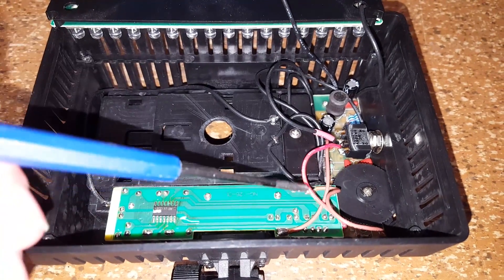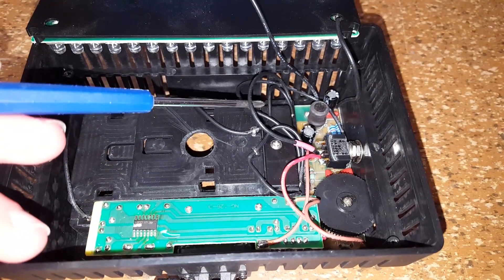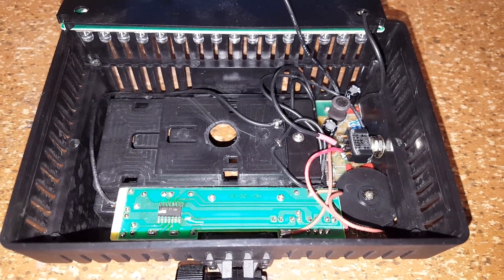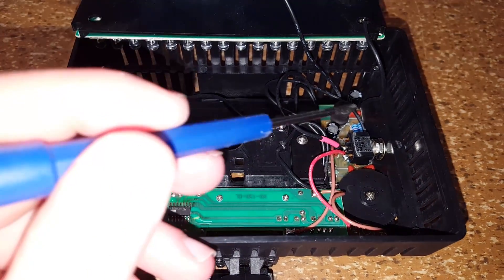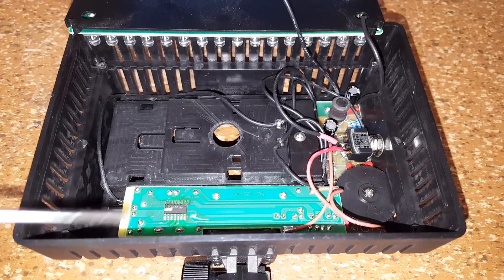The wires — all these wires attach straight to the circuit board, and the original black wires they used are very, very inflexible. So they easily break off the circuit board, and I think that's what happened to the connections going from the main board down to the daughter board with the battery indicator lights and IC on it.